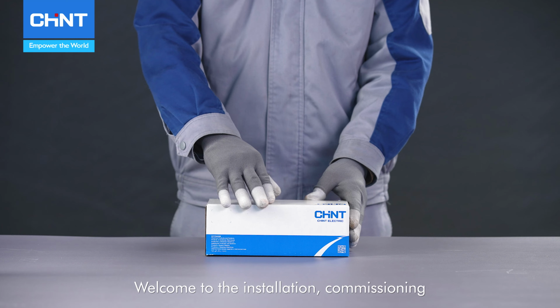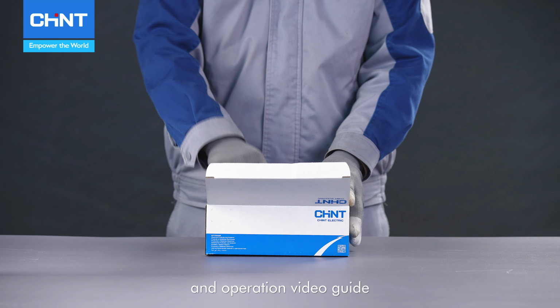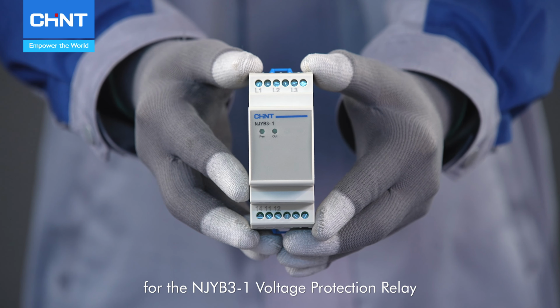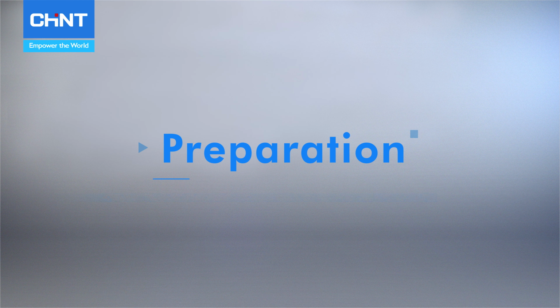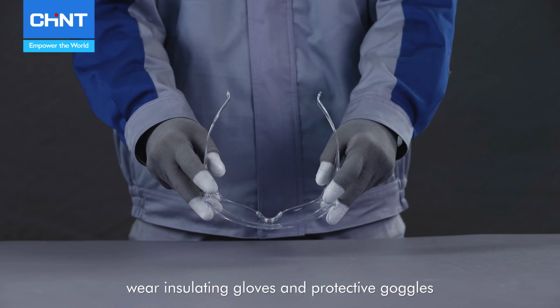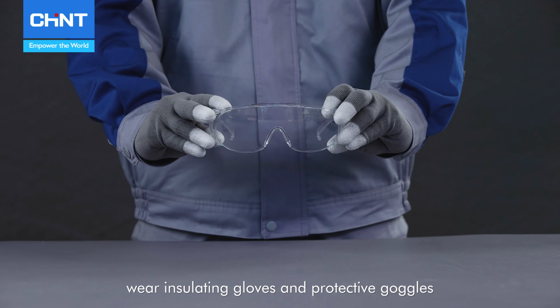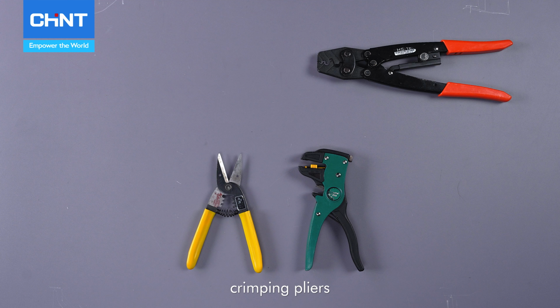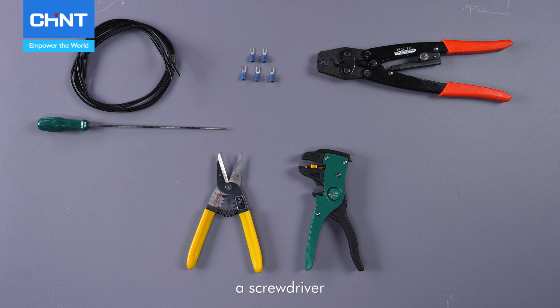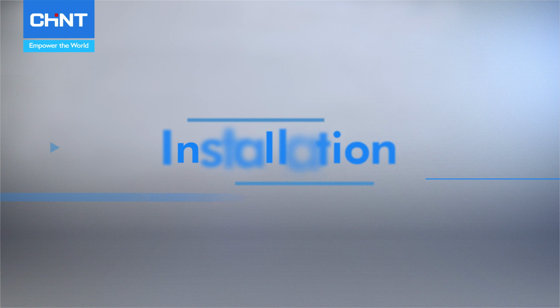Welcome to the installation, commissioning, and operation video guide for the NJYB3-1 voltage protection relay. Before we begin, disconnect the power supply, wear insulating gloves and protective goggles. Prepare wire strippers, crimping pliers, appropriately sized wires, wire lugs, a screwdriver and a multimeter.